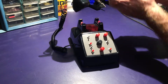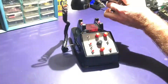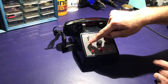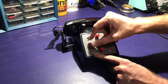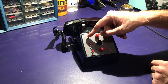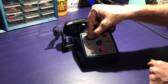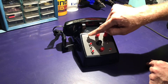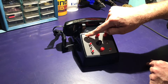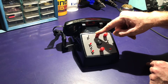You can see with LEDs. And then the audio input feeds into a voice changer that has a vibrato, a robot, a pitch down, and a pitch up control. From there it goes to a bypass switch. So in the down position it just bypasses the spring reverb, but up it engages the spring reverb. So the audio from the voice changer goes through the spring. From there it goes into a delay, a PT2399 delay IC.